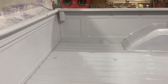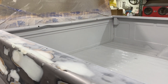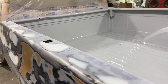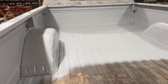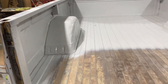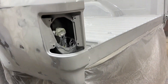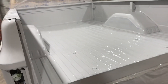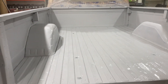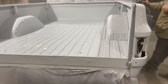Got the gun tuned in pretty good — it really held the overspray down to a minimum this time. I think turning that pressure down and being able to control the fan really helped with that. I wouldn't say I'm a professional with the HVLP guns, but I am definitely getting better. All done in the bed, working our way down around the bottom and in the back — got that all covered.